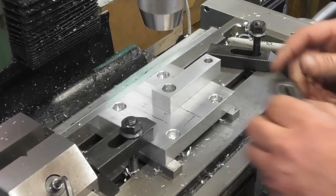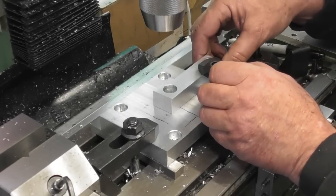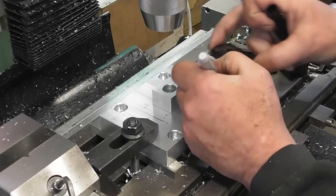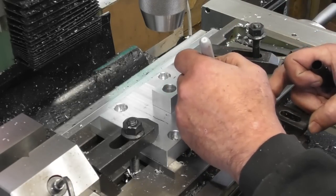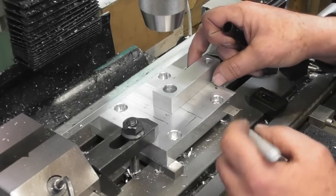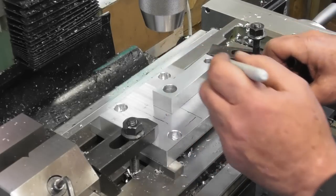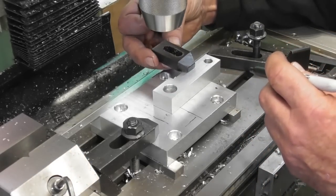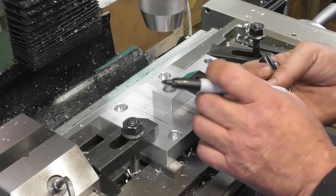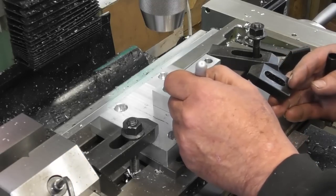I have got some small clamps that work with M8, so I think if we had an M8 hole, let's say something like one there, that would do a clamp into there with a bolt. I'm machining to here, and I'm machining right into here, so I think that's going to be cutting a bit fine. Maybe, okay, what I'll do is I'll put an M8 one about here.